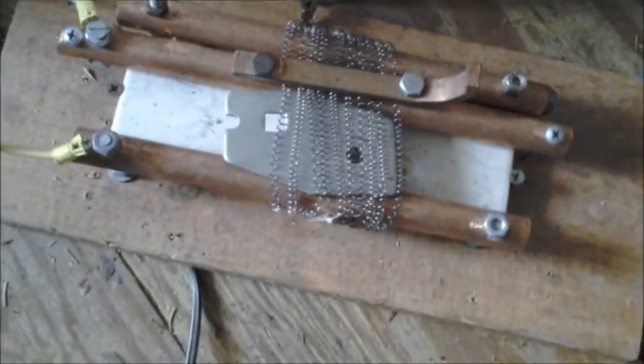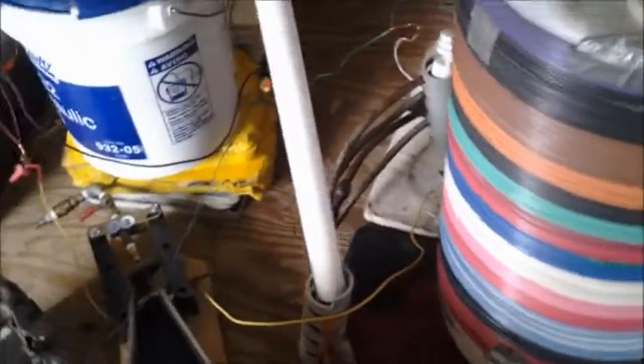I've got my little battery charger charging the battery — which doesn't last very long — and that pulses through this hairdryer resistor, which I've got almost shorted now, as it goes into the three hand-wound microwave oven transformers. They go into my spark gap, and the negative side is grounded all the way from the primary to the secondary, to the negative of the microwave ovens, to the battery, to all the capacitors. The hot side comes out through the spark gap and the hot side of the capacitors into the primary — a typical static Tesla circuit.